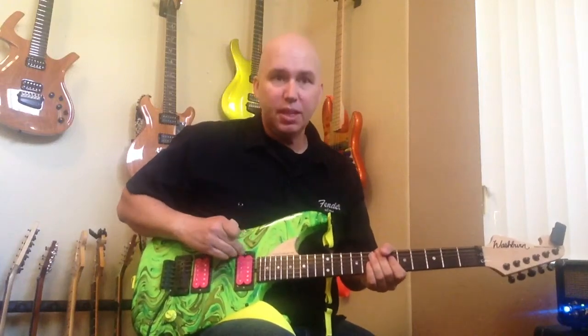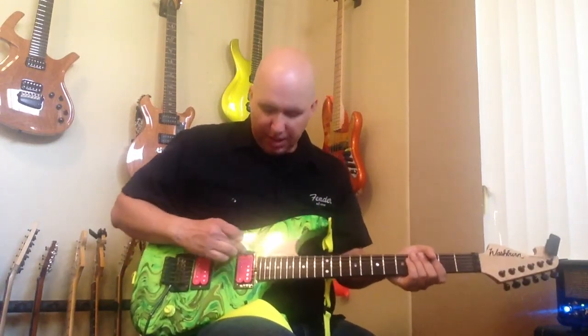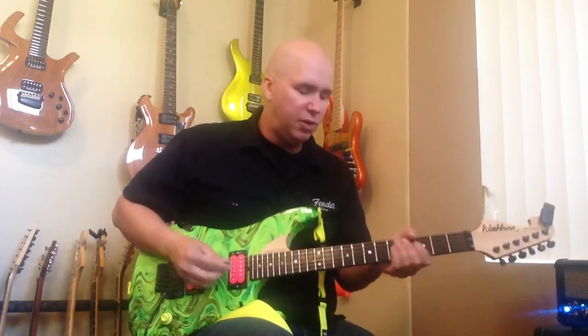There's another feature, and it's called out of phase. Out of phase is basically when a humbucker is put out of phase, it loses all of its mids and lows, and it's just real twangy. Ibanez is really the king of these guys on the five-way blades, which a lot of times they're not coil-split, they're put out of phase. So I'm going to go ahead and run it out of phase right now — this is out of phase.